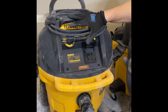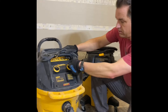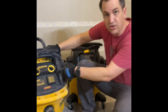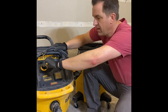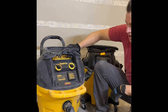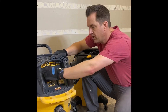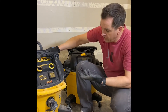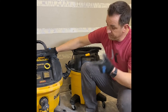The other really cool feature on this extractor is you can plug your tool right into this electrical outlet here. You just set it to that setting on the plug, and then this dust extractor only turns on when I pull the trigger on my tool — pretty cool, so you don't have to go back and forth. You can also select how much suction you want. If you're just sanding something light you can dial it down. When I'm doing concrete I crank it all the way up and set it on the plug feature so the dust extractor turns right on when I start grinding.